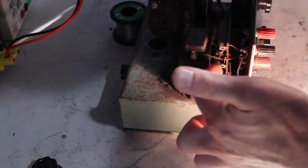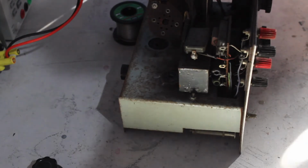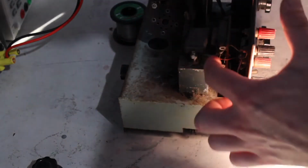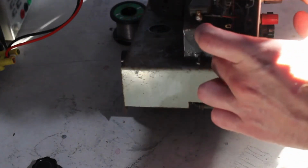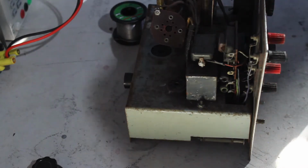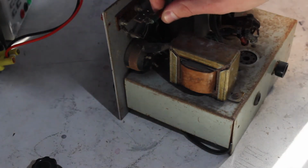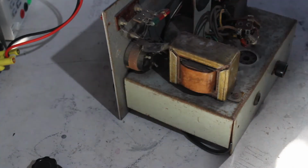See down behind here, the resistance standards, there are some more modern looking composition resistors in a more familiar modern style packaging down here that have been used. And I can see these tubular ceramic capacitors, the special kind, the low tolerance ones. There's that light bulb there that I mentioned. There's the neon behind here for the leakage tester, with just one series resistor for that. It's very unusual looking color coding, which is pretty old fashioned. I've not seen it before.